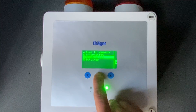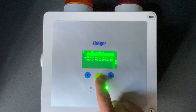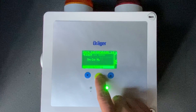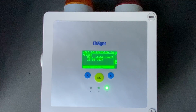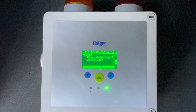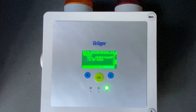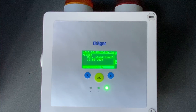You scroll down for calibration and click zero calibration. It's going to ask you to apply your nitrogen bottle. You're going to open your cylinder until the value stabilizes at zero. Typically this will take 5 to 10 minutes for it to stabilize, and then you can press OK to calibrate.